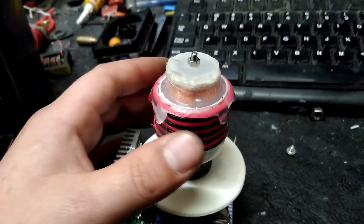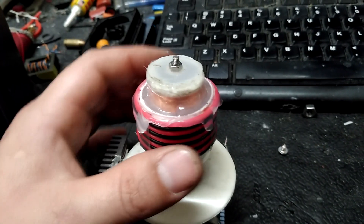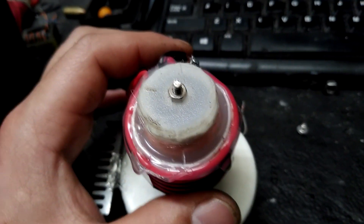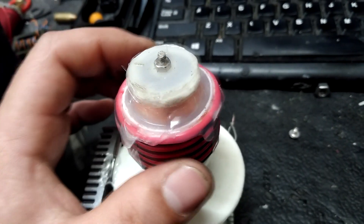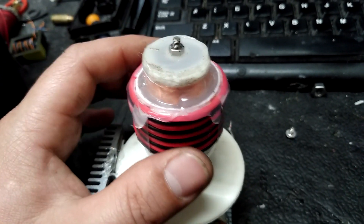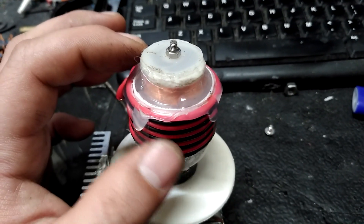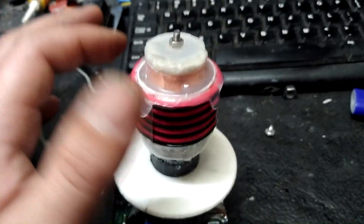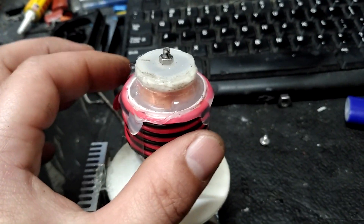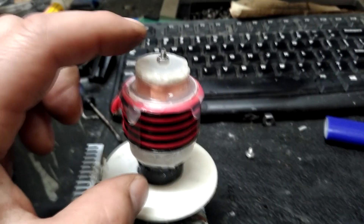As far as the coil goes, I had to move the primary up here and insulate it. I really just decided to fill it with hot glue because I had the outside of this coil wrapped in clear tape. I came to the conclusion this particular coil — which is about 2 inches high, 1 inch wide or so — was not quite big enough. It still works, but I would probably want to rewind something that's either an inch and a half in diameter, basically just scale this up slightly more.